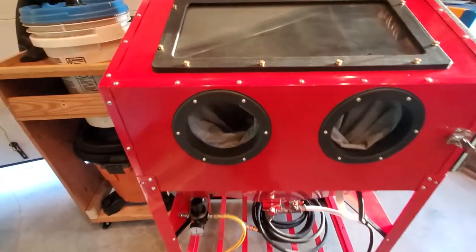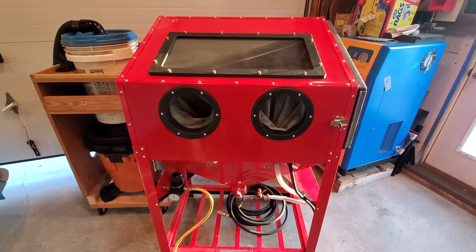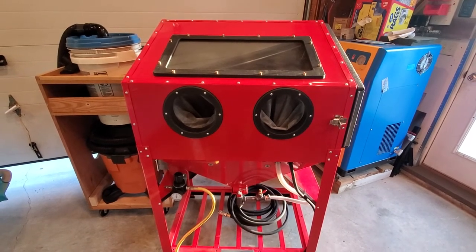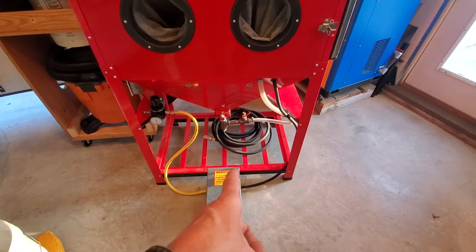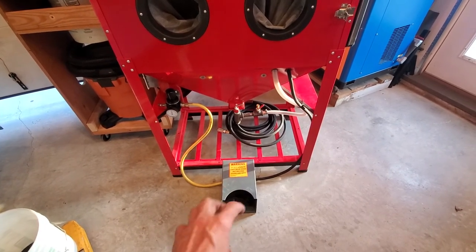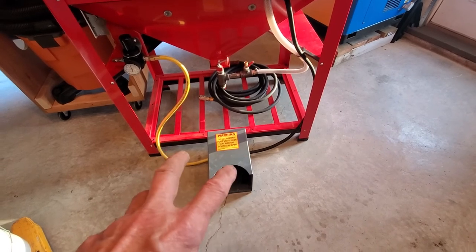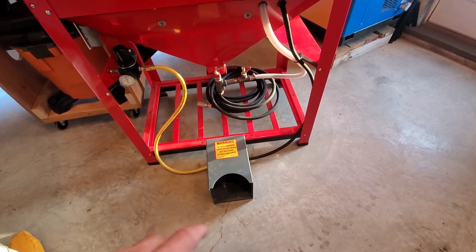Hopefully this might help somebody else down the road — my version of the Harbor Freight sandblasting cabinet. There are vendors I wouldn't recommend and wouldn't give the time of day to — ones that would never communicate by phone or email. There are some that I would recommend. The only thing I bought away from my area was the Trinco gun and three-eighths foot pedal — it came with a small safety pedal that you had to press to engage, which I took off — a little overkill. This is $130, but it is a three-eighths NPT, not a quarter NPT. If you don't care, a quarter NPT pedal will likely get you by just fine for under $40, maybe $15 to $20. But sometimes you get what you pay for — just be aware of that. Happy trails.